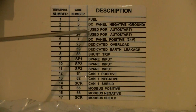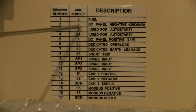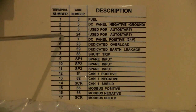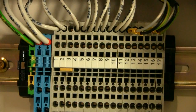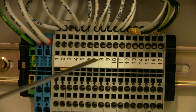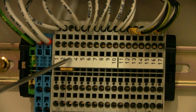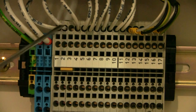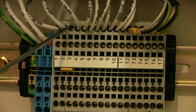They would be wire number five hooked up to terminal three, and wire number 24 hooked up to terminal four. So according to our label, terminal three should have wire five on it. If we follow it up, we notice that there's not a wire there.